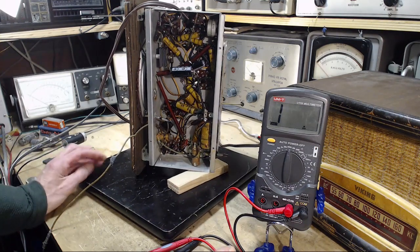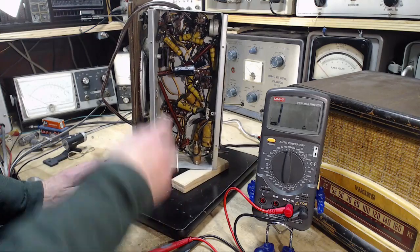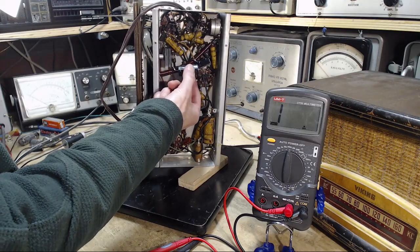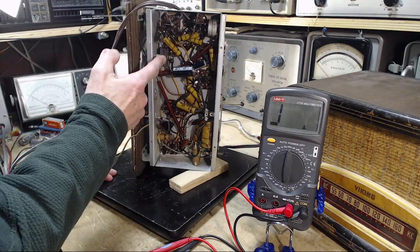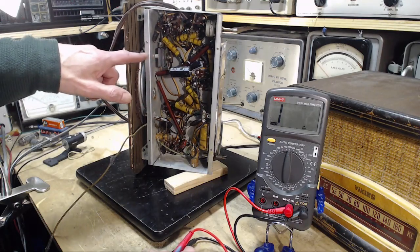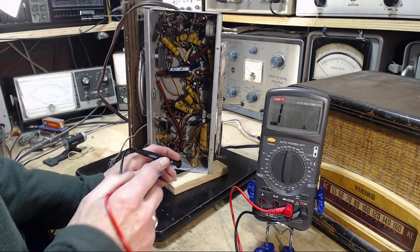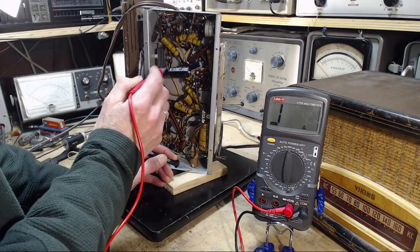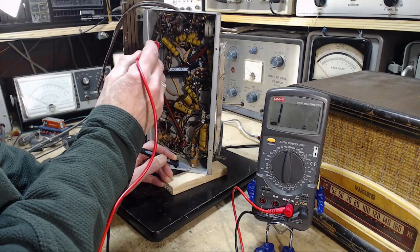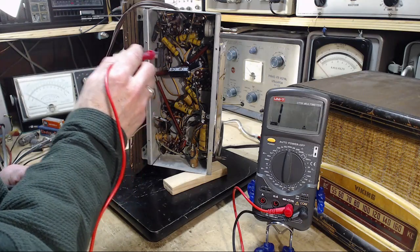It's really quite simple, except for the fact it's just like working on the big capacitors. When you remove them from the circuit, some terminals disappear too, and then you've got components with no terminals to go to. Already in this radio, they've used this connection to steady up this, which is kind of floating out here. This is one of the connections that's going to, of course, the rectifier. The other connections here, and you see the rectifier is bolted onto the chassis, but I'm pretty sure it's not actually connected to the chassis, so let's check that out. Just make sure, just watching the meter. There's one terminal and the other. Yeah, what happened there?